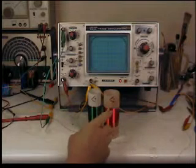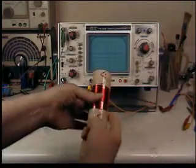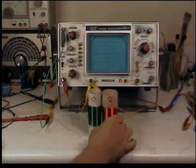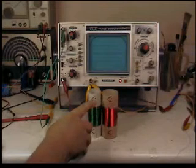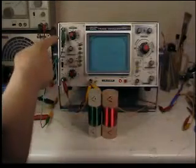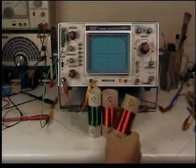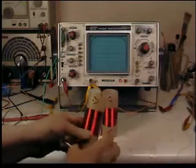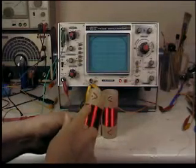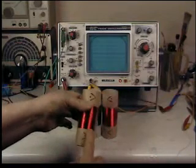The arrow means that the wire comes in here and goes around and around and around and ends up here. I also marked the top and bottom, and added a dot here which means this is the part that goes up to the scope. I also wound another coil — when I hook it up, this dot goes right there, and it's wound in this direction around and around until it comes out here.